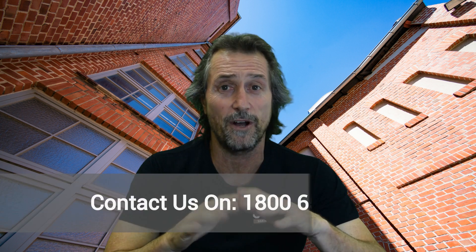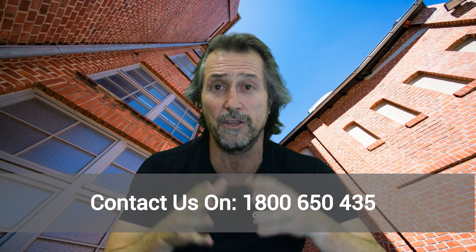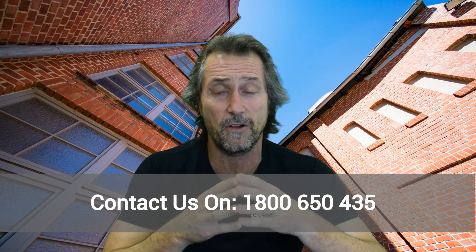If you are not certain, don't be afraid to ask. You can contact us at any time — you can FaceTime us or take a photo and get it to our team. Discuss it with your client or the builder, and if they're not sure, get an engineer in. I'm always concerned when someone can't tell us what the expected movement of an expansion joint is. You need to understand that movement parameter and then design your system around it. There's a big difference between a control joint and an expansion joint — make sure you don't get caught out. Sealed for Good — I'll see you next time.